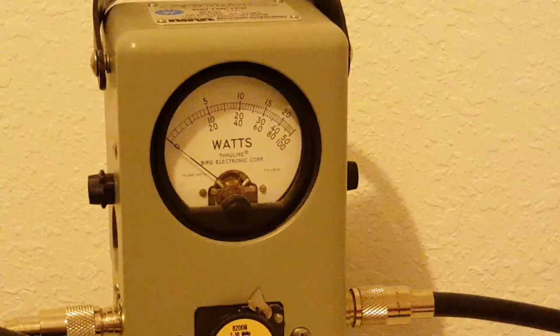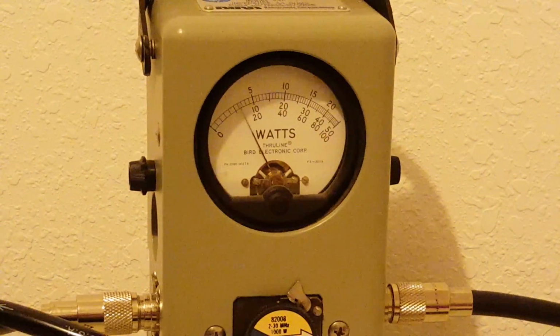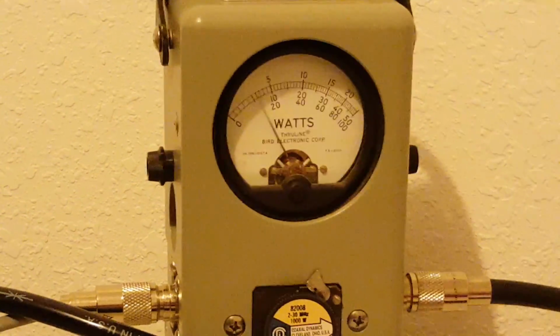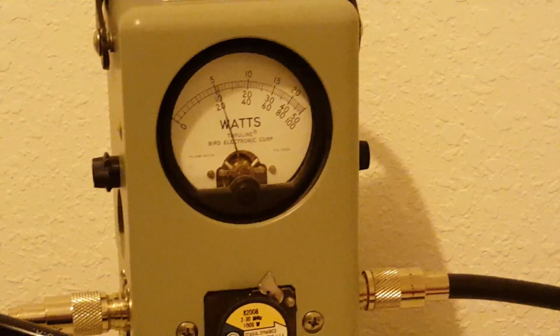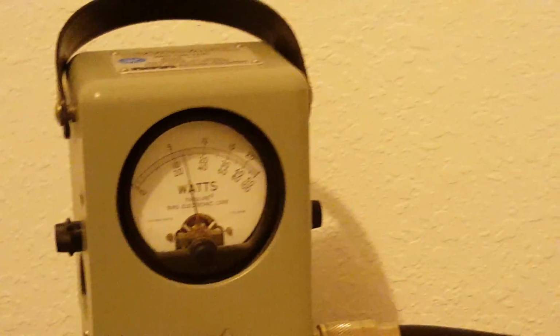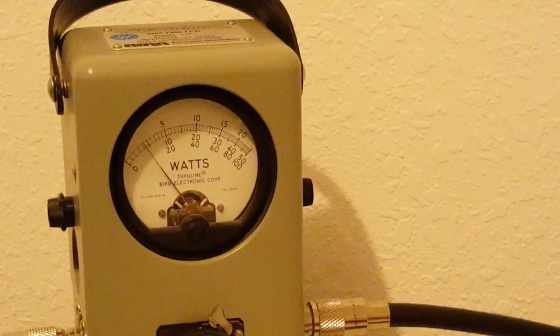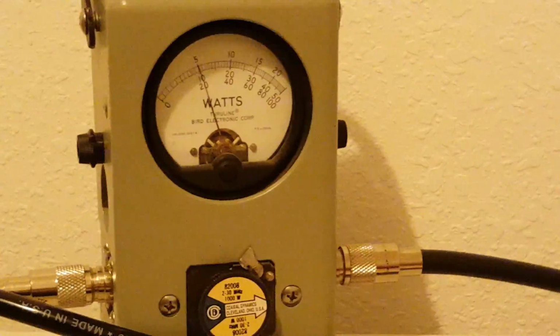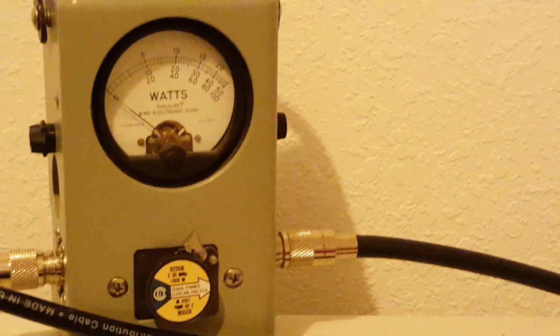We'll turn it up to 11 o'clock. Audio, we gain a little bit on our average. About 190 watts average. And we'll go all the way open with it. So, wide open now. Turn our carrier back so we're not overdriving. Audio, and right at 200, 205 watts average.